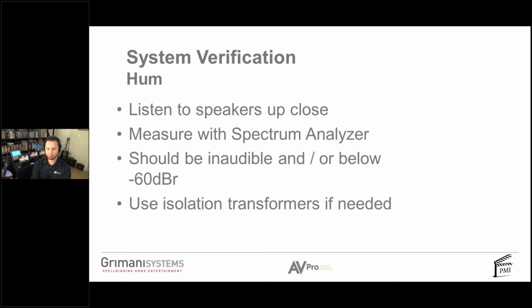It's really not made to be an isolation transformer, but it's a box that has an unbalanced input to balanced out that you connect through Cat5. It's a way to extend line level signals through a Cat5 signal. And the hi-fi version of that is a good isolation transformer. So you sort of hack that thing up, but you can put it between your surround decoder and your amplifiers, or between EQ and amplifier, wherever you need to do the isolation. That works okay.